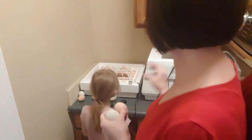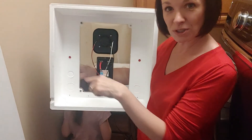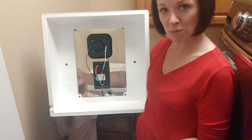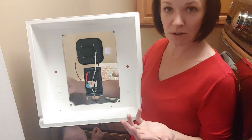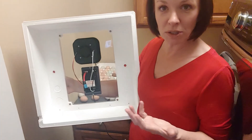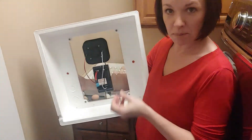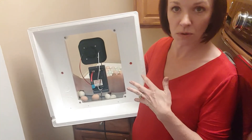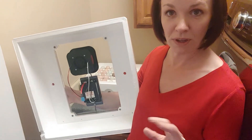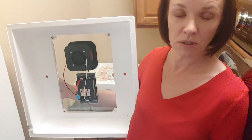I'm very pleased with the Farm Innovators 4250 so far. It has all the bells and whistles of the previous incubator I reviewed, without the design flaw — that one had all the circuitry in the bottom, so when chicks hatch all the goo and droppings fall onto the electronics and you can't wash it without destroying it. On this one, all the circuitry is in the top, keeping it cleaner. It also has better temperature control — the previous one's lid got warped, wouldn't stay closed, and created cool spots.